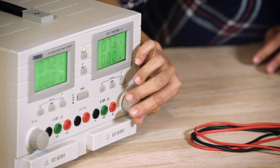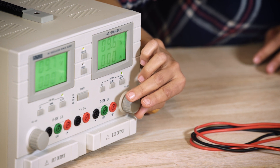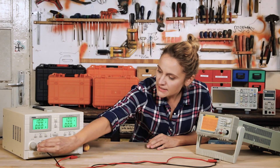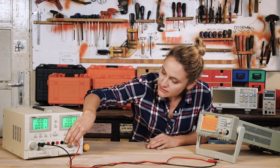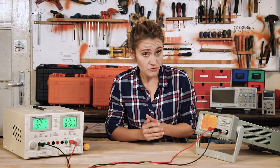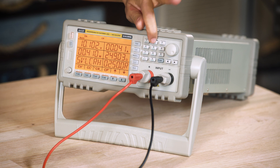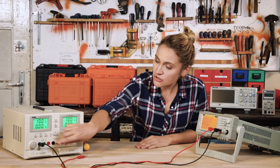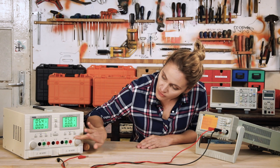To demonstrate, we are going to use the electronic load. First, set the voltage — let's say 10 volts — then set the current limit on both channels to 20 mA each, giving 40 mA in total. 10 volts by 40 mA means the critical load resistance is 250 ohms. If the load is less than 250 ohms — let's set it to 200 ohms — the current limitation will turn on. Remember: when you have finished, turn the knobs to the lowest position.